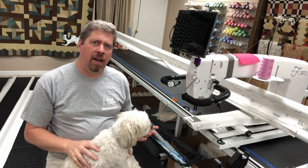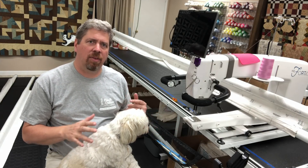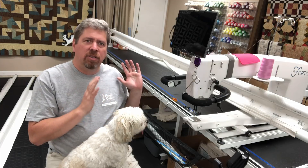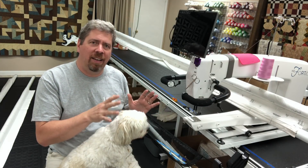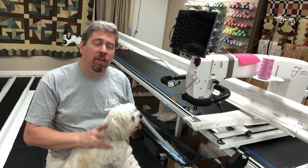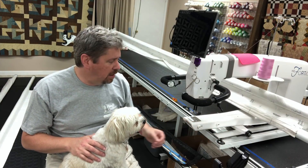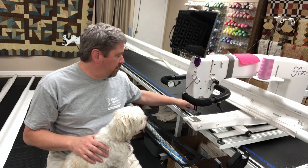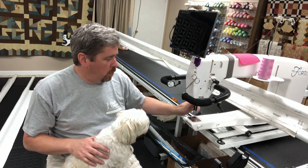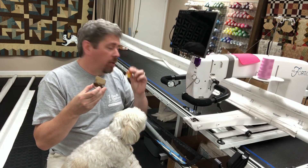Samson and I have removed the bars from the table. But if you're in the middle of something where you have the quilt on the table, just move the machine all the way to the farthest end so that you can get around to the front and the back of the machine, which is important. Take the thread out of the needle. Take the hopping foot off — this is the new Glide 2-foot. You then need to remove the needle plate; two screws, a small screwdriver helps.